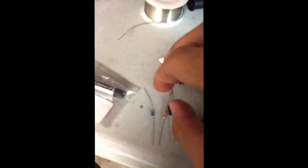And that's the one that will have the 100 ohm. And the 2.2K will wrap from the far right to the far left. You'll just have the whole resistor on that black there by the back close to the heatsink. And that's where it'll be at. And then that diode, when that's bent around, it's kind of at an angle, at a slant. And so I bend this.